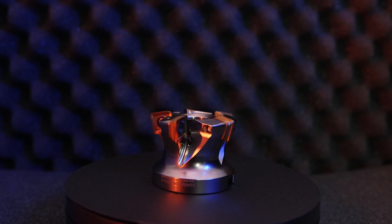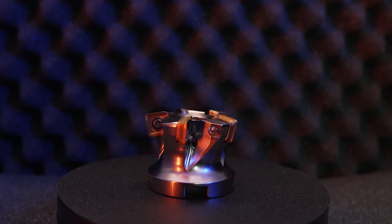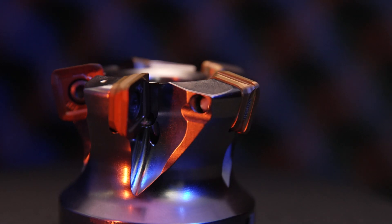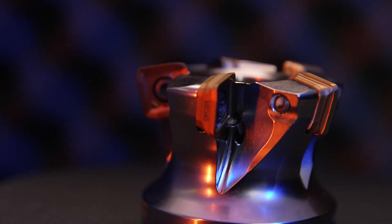Hi-Feed — give us an explanation on what a Hi-Feed cutter actually is and what it's used for. It's in the name: it's designed to run at hi-feed. For this tool, running on a stainless block, you're looking at 160–170 meters a minute, 1 mil per tooth, up to 1.9 mil depth of cut on a strong machine.